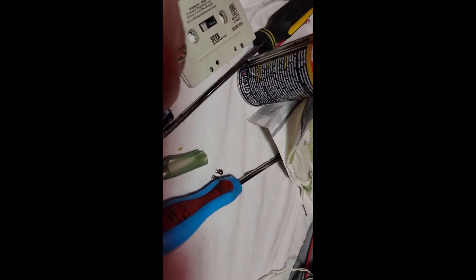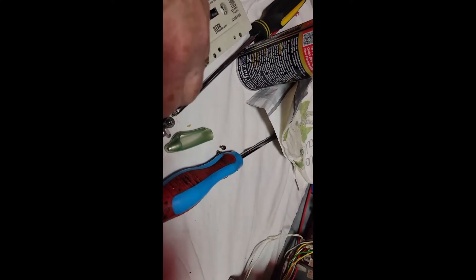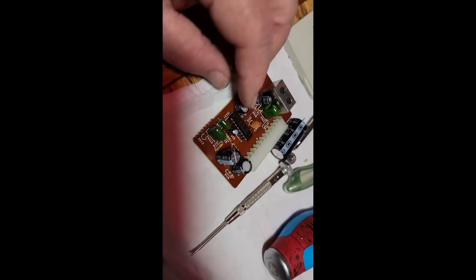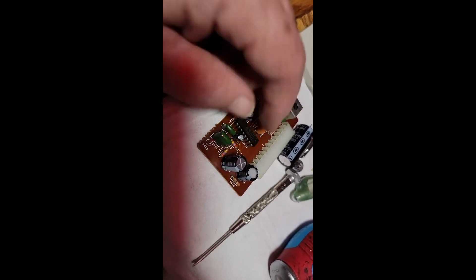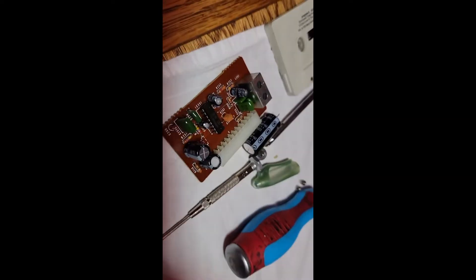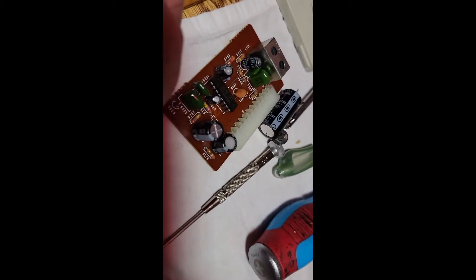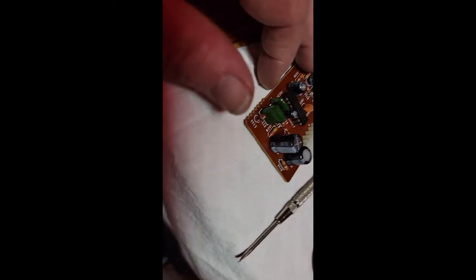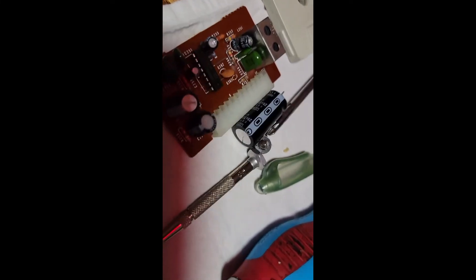What happened is you turn it on, play music, the right channel is fine but the left channel has a very high frequency — like a 1000 Hz squeal, really bad. How I found out: I sprayed it with canned air upside down to freeze it, and the noise went away. As soon as it started to warm up it was howling like a wheel. I have the replacement IC coming in. I've already replaced two of these, so I'll replace the other one too, just to be sure — if this one failed, the other will probably go bad soon.